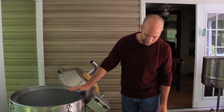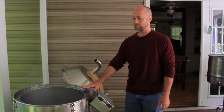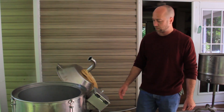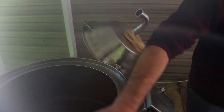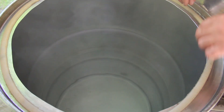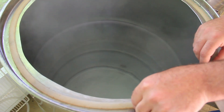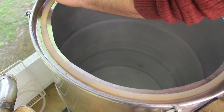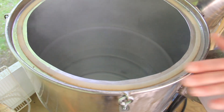This is the boiler, made of stainless steel barrels — a 55-gallon drum. Everything is stainless, it's electrically heated. It's really just a barrel that's been polished up and has a few little brackets welded onto it. We don't want to lose any essential oil through vapor before it can be condensed, so this just makes a seal between the basket and the boiler.